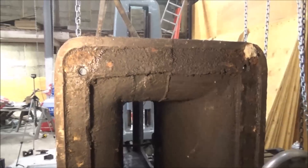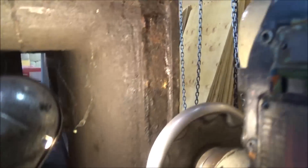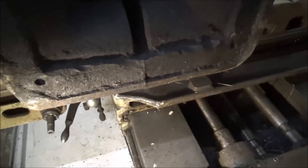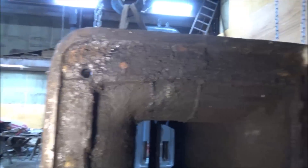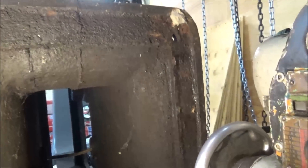So let's take a look at the bottom of this casting. This is a glorious piece. You can see the parting line there — nothing whatsoever done to it. It's kind of got like a foot there, or maybe it's just a lump. Got a hump there at the parting line. Doesn't look like any sort of finish work went on this side at all. I don't know what they did — if they just threw it up on some boards or what they considered for that to be. It looks like it would have made it hard to work with this thing. But that's the way they did it. That's not how I'm going to do it — I'm going to try and get all this milled to a decent something to start with. Then hopefully I'll be able to flip this upright, square it up, bolt it down and do the rest.